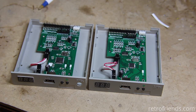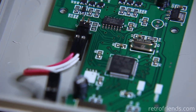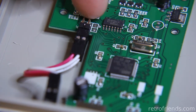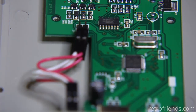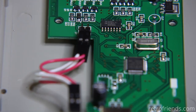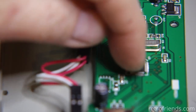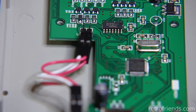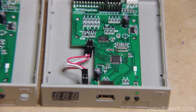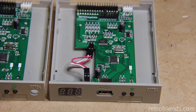Let me get a close-up so you can see what's going on. We have the ST chip with the two unpopulated jumper pins for the rotary encoder, and over here a physically smaller Artery chip with no pins for the rotary encoder. It wouldn't do you any good to try to find PC10 and PC11 legs on this chip — there is no 'C' port data output; it only goes up to 'B'.